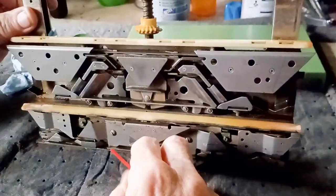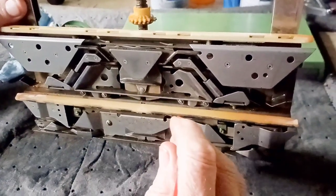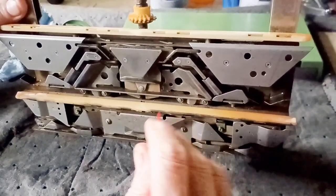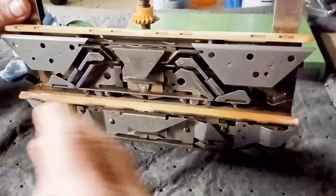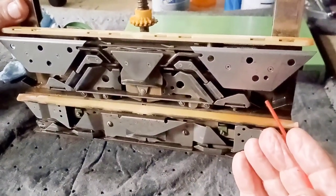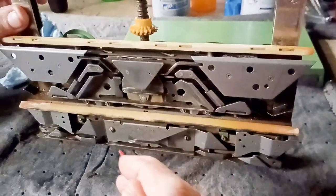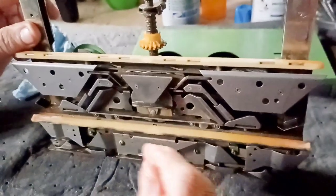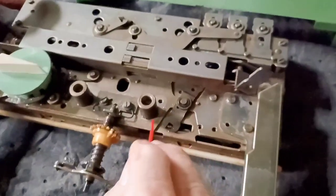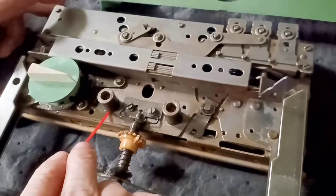Yes, just as we have said in many videos, after it's had Marvel Mystery Oil soak, use some scrap yarn. You're going to see some crud come out. You're going to see some mystery oil even come out after you manually try to clean it. Right, and I have cleaned and cleaned and cleaned. So when those things come out, you got to put lubrication back in. That's what you need to consider. If some crud comes out, you need to get lubrication back in.